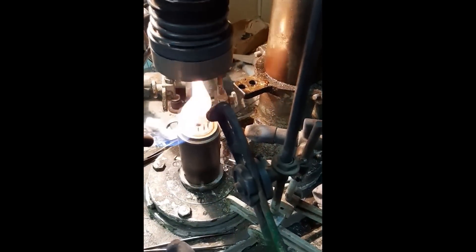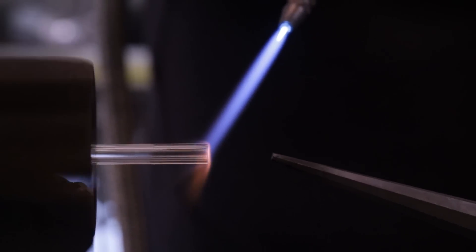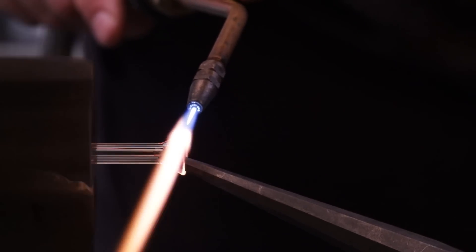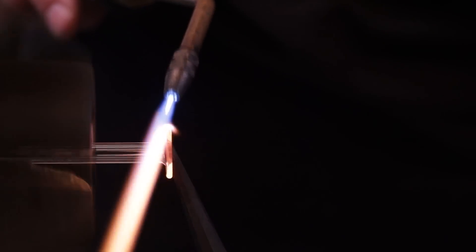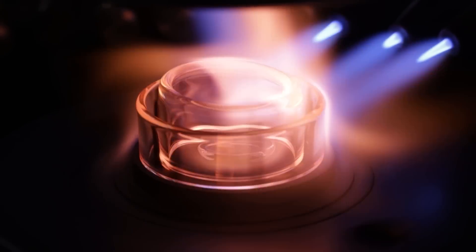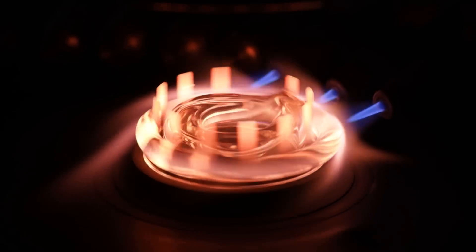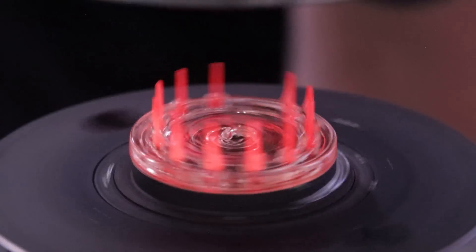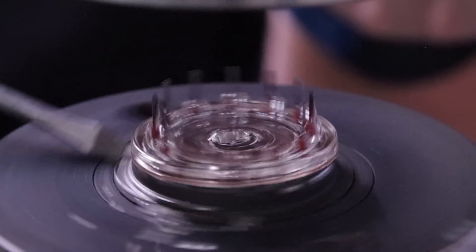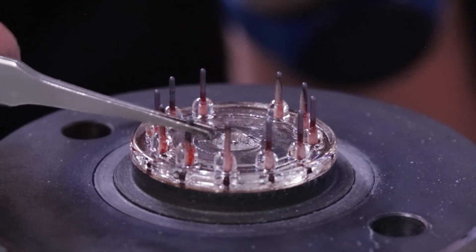Making the flange on the exhaust pipe is an additional step in the process, so it's an additional complication, but since we want to try and learn it, I made a few of them. Here I have two rings and the flanged exhaust pipe. I'm also using an additional nozzle pointing towards the center — the internal ring melts quite easily this way. However, because the inner ring was too tall there was too much glass, so it completely covered the exhaust pipe, which is not good. Also some glass melted and got pushed through the gap between the edges of the mold, spreading all over the lower mold.